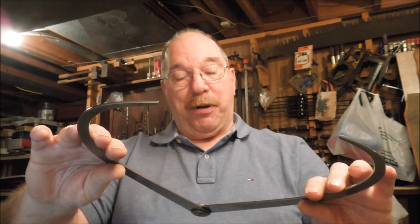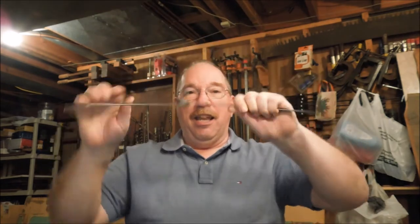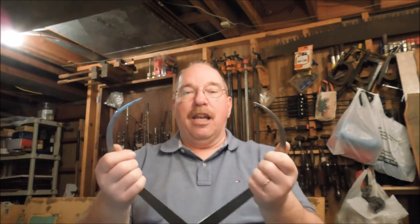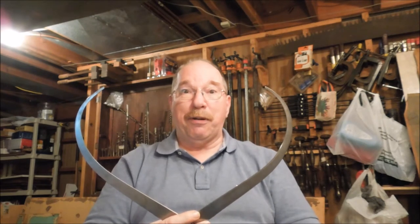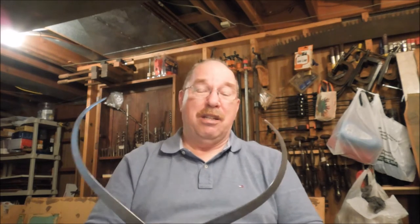This is a Union caliper, and the idea behind a Union caliper is for woodturning — quite often the things are quite large. Where I used to work we had a four-foot vernier caliper, which really when you think about it, how often are you going to use that? Well, we actually did use it quite a bit. We were making pump parts, and the pumps were big enough to walk into. Most of the time the fit was not that precise — we could be within two or three thousandths and still be okay, so that vernier caliper worked out just fine for that.